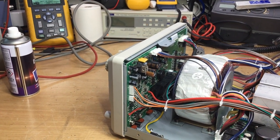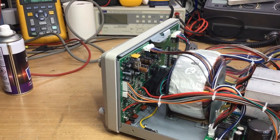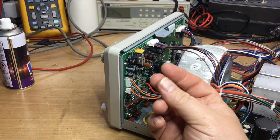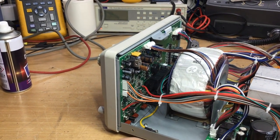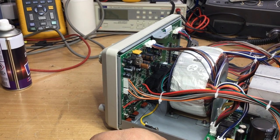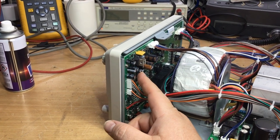So naturally, that means to me, and so would any experienced electronics engineer, that the smoothing capacitors are not functioning as they should be. But obviously then when I touched them and found that they were hot and the smell was on the finger, I've marked this capacitor with a biro felt pen to identify it, so I know to change it at a later date if I don't get time to do it tonight. I don't forget which cap it was. All the other caps didn't feel hot or warm to the touch.